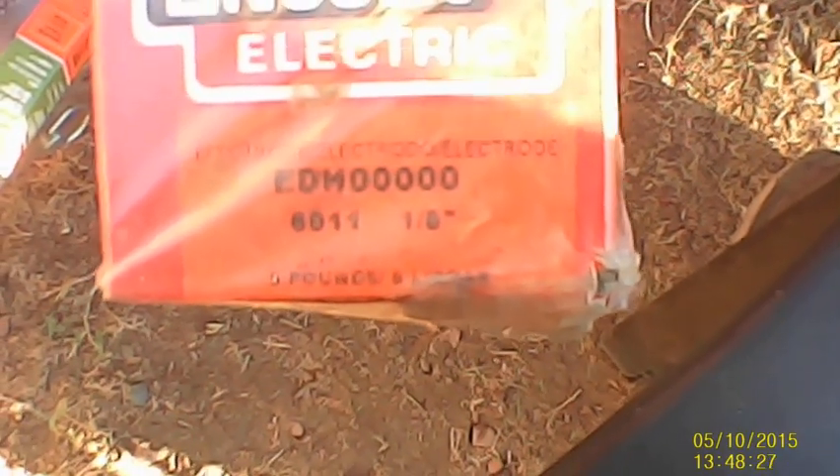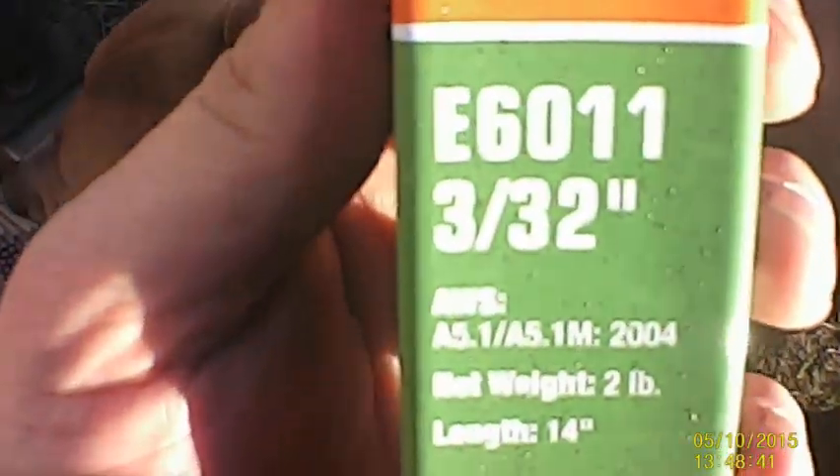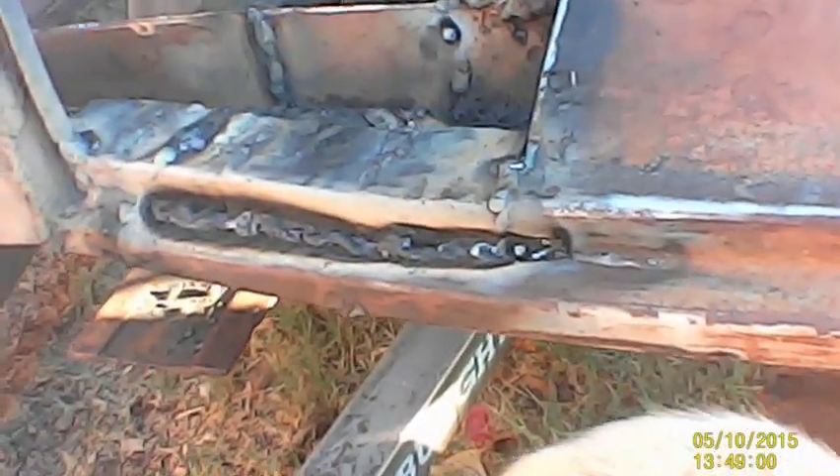I was welding and I'm blowing through the sheet metal, and I was trying to figure out in my amateur ways why I'm doing that. It turns out I'm using 1/8th rod, 6011. 6011 is what I want to use because it goes through rust and paint, but I dropped it down to 30 amps. Not much more of a drop, but Frankenstein here has now welded without blowing through the sheet metal. So I'm actually starting to get a car put back together.